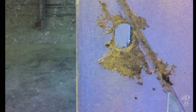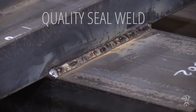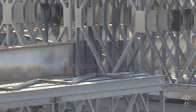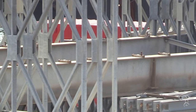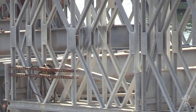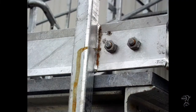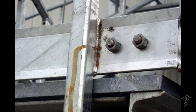To avoid weld blowouts, there must be no weld imperfections or pinholes which lead to the entrapment of cleaning solutions. The second issue, called a weeping weld or rust bleeding, is not noticeable right away, but appears as staining of the galvanized coating at welded connections. Weeping welds occur after pre-treatment chemicals become entrapped between small gaps and overlapping joints that the more viscous zinc cannot penetrate. Over time, these entrapped chemicals interact with moisture and create rust that seeps out of the joint.